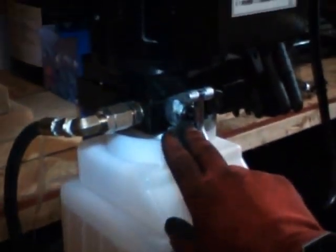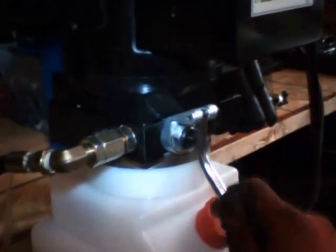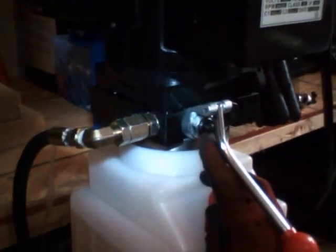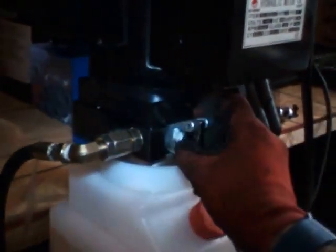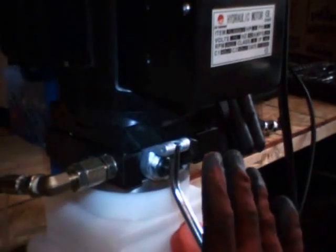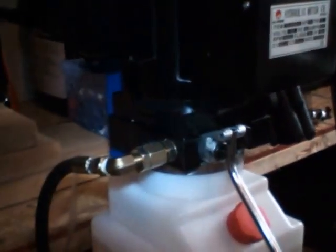So I reported that to the technician, and he said that the problem was the release valve, which is this one right here. They sent me a new piece. It took around 2 days after I made the phone call. I removed the bolt, removed the release handle, pulled out the release valve, put the new one in, put everything together, and the problem was fixed. After that, everything is fine. I have no more issues, no more complications with the unit. I just have to let you know, I'm going to show you when I raise the lift.